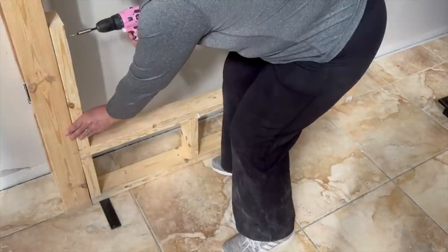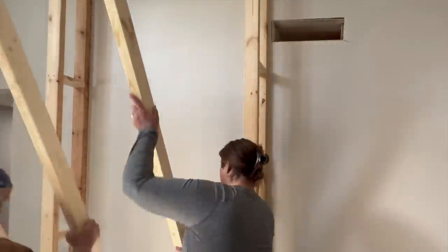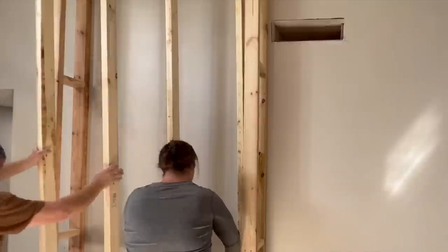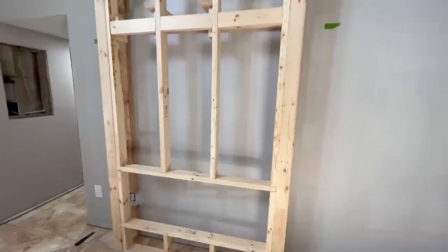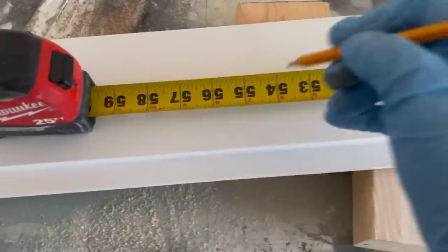I added 2x4s to help create an area larger than this for the fireplace to sit into and attach to. I created one more frame — the upper frame — similarly just 2x4s up to the ceiling. Once that upper frame was put together, I had some help lifting it in place and then secured that with several screws. I also added some 2x4s approximately where I thought the TV would mount. Okay, that was the hard part — now let's get on to the fun part.